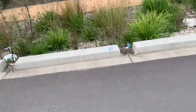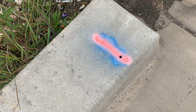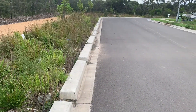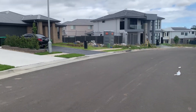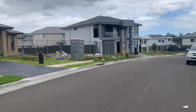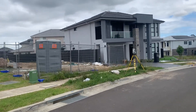Here's another one here — you can see surveyors like to use blue and pink and yellow. I would recommend using white paint on the curb and gutter, especially near people's driveways, and for the state survey marks I would recommend using yellow paint. Now that we've found the survey marks we're going to use, it's time to set the instrument up and start measuring.